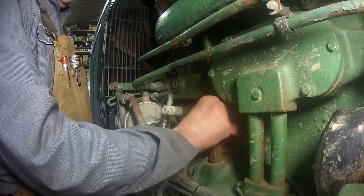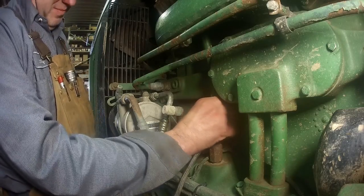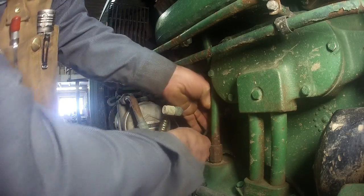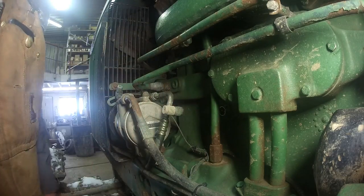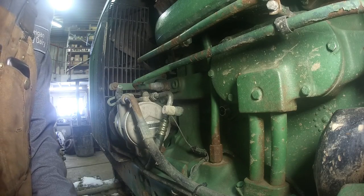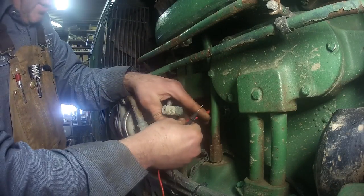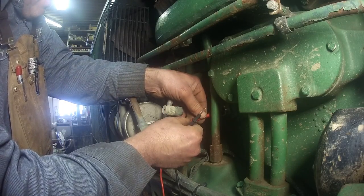The cord looks okay. So we're just going to get an ohms reading on this block heater itself. More than likely, we're probably going to have to put a new element in it. But at least it's in the shop here. We've got a cold snap that we're dealing with now, and it's supposed to be cold like this for the next 3 or 4 days. So we're just going to get an ohms reading on this. It should be anywhere from 13 to 19 here.